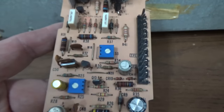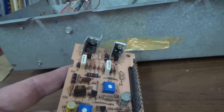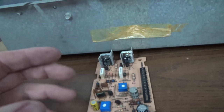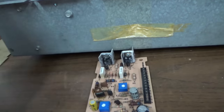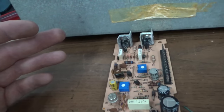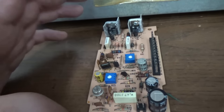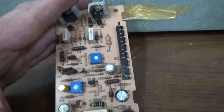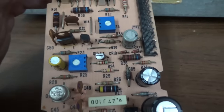But a lot of times, for whichever one you're working on, you can download the manual or buy one. Even if you have to buy one for $30 or $40, it's worth its weight in gold because it tells you how to do things like adjust the bias, and it tells you the part numbers and stuff. There's probably 30 or 40 adjustments you can make depending on what you've got going on. The schematics showing how everything connects, how the amplifier connects and all that — it's worth its weight in gold if you can find one.